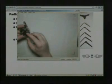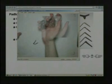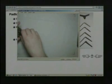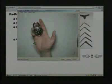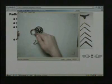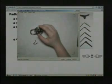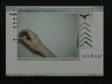When you want to open this lock, you dial in your combination, the bar is out of the way, and you open it. Well, let's say you want to lock my stuff up. You're not going to sit there and dial in your combination again and slap it shut. You're just going to, bang, slap it shut, because that bar being spring-loaded will just get out of the way. Well, the bar doesn't know why it's getting out of the way. It doesn't know what's pushing against it.